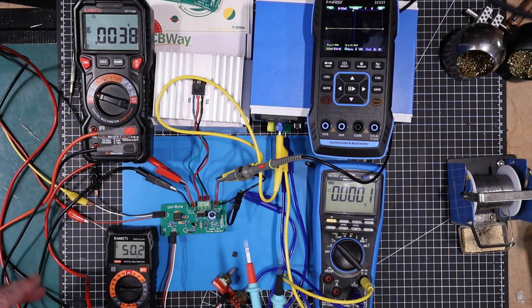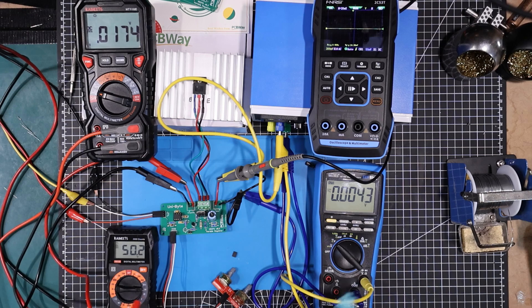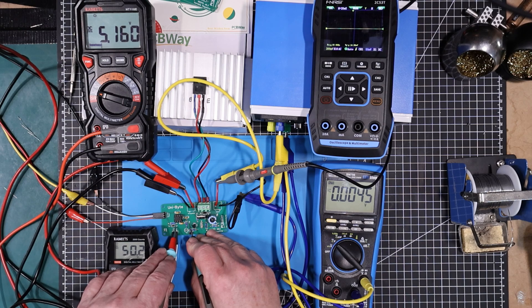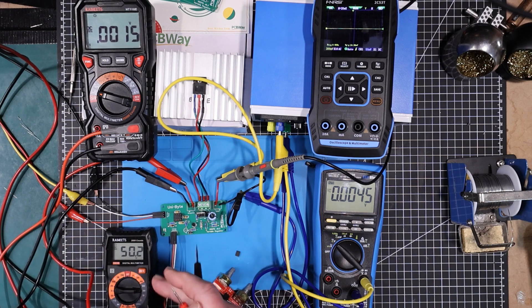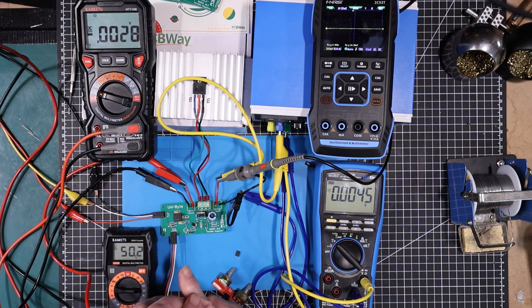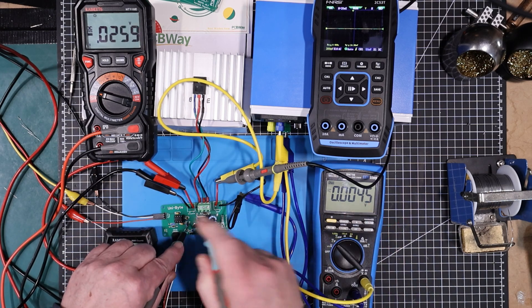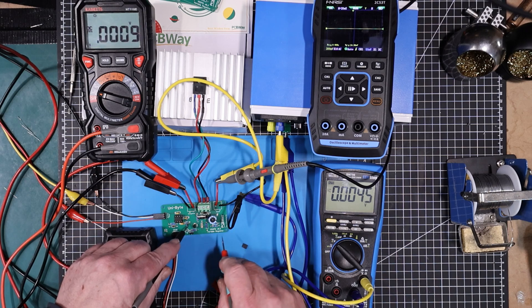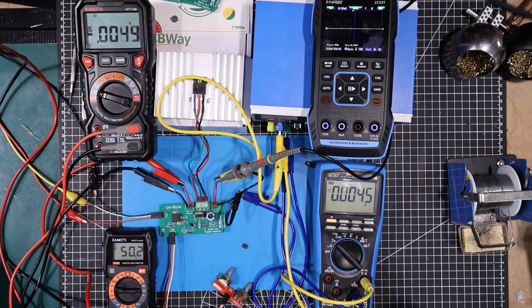Okay, we've got the same basic setup here except the ammeter has been taken out of the circuit. Let's power it on. We've still got that voltage there, so let's check the voltage reference first. 5.1 volts. And I want to check this voltage here — if we're getting a voltage here as a result of the op amp attempting to turn on... yeah, we've got 0.68 volts here, so it's determined to turn on the output. So I think the offset null adjustment would be a good thing to have there. We'll put that in the next iteration. Let's try and see what the dropout voltage is.